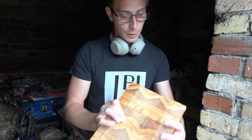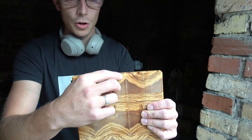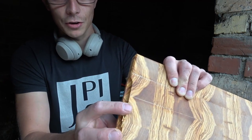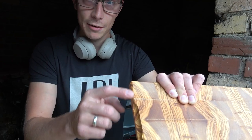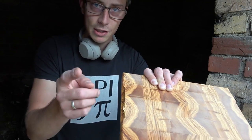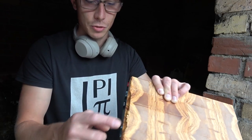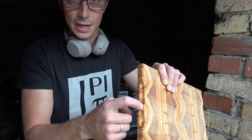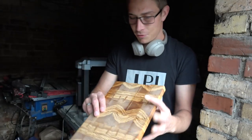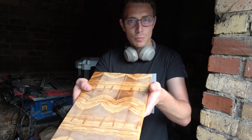And here's the problem I was talking about - I was dumb enough to not put any chamfer onto the handle, meaning I'm going to get tearout on that part. But on the parts where I have a chamfer, I'm not getting any tearout at all. So definitely make use of some chamfer to get rid of this problem. But it doesn't really matter - I can just use my router table to get rid of the ugly part again. Two or three more iterations and we should be good to go.